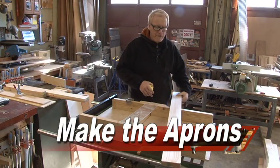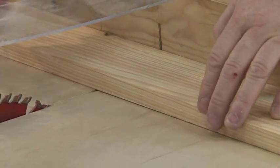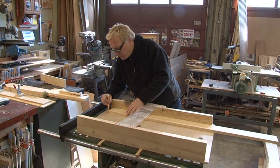Our two fresh edges on the outside and our tongue-and-groove center will help our glue joint. It also lets you know the history of these boards when it becomes a table top — it's a tongue-and-groove floorboard. It's going to look gorgeous against the fresh pine base. The top needed two pieces, nine inches each, giving 18 inches total — that dictated the size of the table top. It was thought out: I didn't want a squat, monolithic-looking table, so I searched for materials. I found these pine boards at the home center and it worked perfectly.